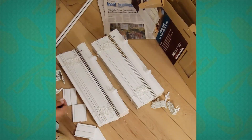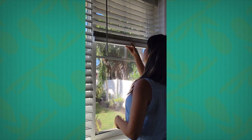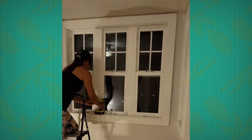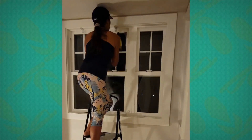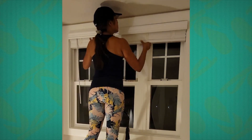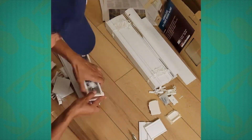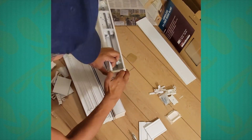It's really easy — if I can do it, you can do it too. If you're hanging your blinds inside a window casing, that's called an inside mount. You'd want to measure the width and height of each window first. From the width, subtract 1½ inches to allow space on both sides of the blinds after they're installed. Hang the support metal brackets by marking the holes for the screws on the window casing first, then drill the marked holes and install each bracket using a drill with the screws that came with the blinds. After the brackets are installed, slide the header of the blinds into the brackets and lock them in place. Finally, install the plastic clips to the blind header, assemble the molding assembly, and install the molding on the plastic clips. From there, you're ready to go.